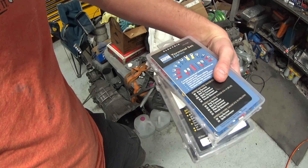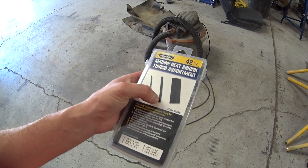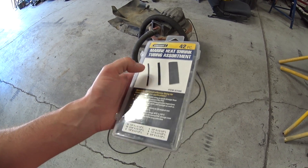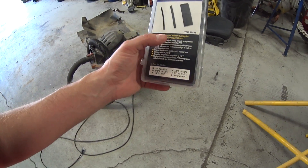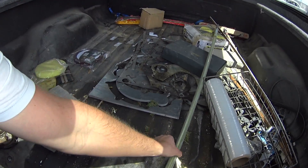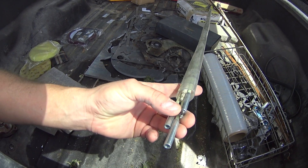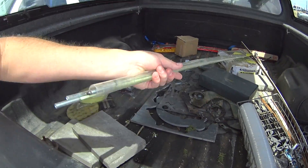I have shrink tube, I have these fittings, and then I have the little clamps for the wires. I get the marine heat shrink — it's not really marine, but it's a weatherproof heat shrink tube with adhesive lining. So once you shrink it, there's no water ingress into whatever wiring you do, so you don't have to worry about corrosion in the wires later on. It pretty much seals it up. And these are those fiberglass poles I was talking about — there's a little end right here, and you just loop a wire through it and pull it through.